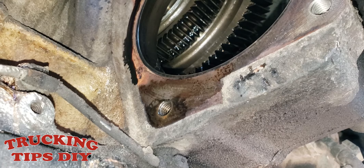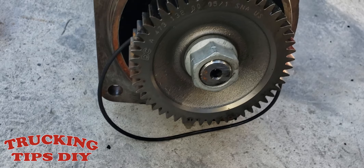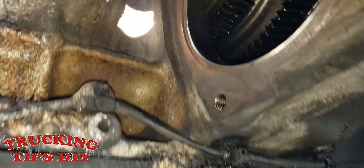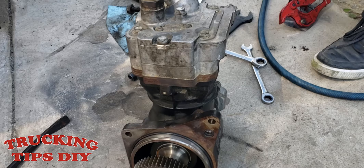We're going to bring it up the same way we brought the other one down through here and put it back up there. We're gonna clean all the surfaces — there's no timing needed on this one. Just make sure you put on the new O-rings: you have the bigger one and then the small one for the oil — so you won't get any leaks. We already cleaned everything up and have new airlines, and the broken hose is replaced with new O-rings on the new compressor.